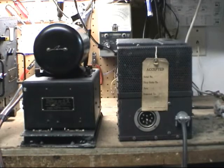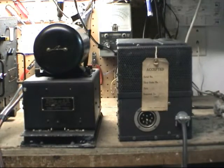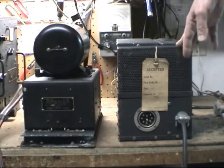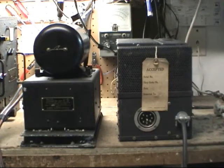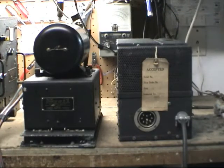To power the SCR245, you had a couple of choices. You could use a vibrator supply or you could use a dynamotor. The one I have here is the PE55 — that's an earlier dynamotor. It's only 12 volt, not selectable 12 and 24. The later selectable dynamotor unit was the PE135AX. The other choice is the vibrator unit, the PE125AX, which is also voltage selectable 12 and 24 volts. It uses two plug-in vibrator units and two voltage regulator tubes, and it's a nice alternative to the dynamotor if you don't have anything to drive the dynamotor.